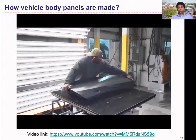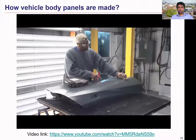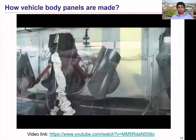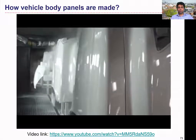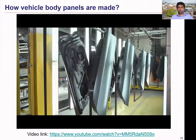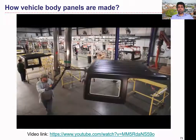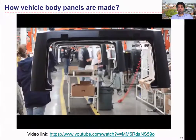Once each shift, one part is selected to undergo extensive quality testing, where an operator performs tests to check for surface finish, gloss, paint adhesion and thickness, and overall paint quality. In other instances, the component is primed and then top coat painted by CSP in one of their state-of-the-art robotic paint facilities, where similar quality audits and surface evaluations take place. In some cases, these painted parts undergo final assembly processes and are sequenced for just-in-time delivery to the OEM for final vehicle assembly.